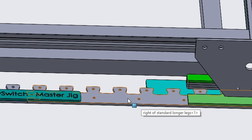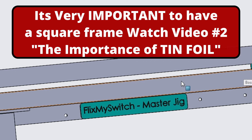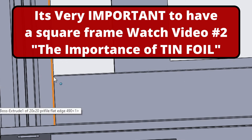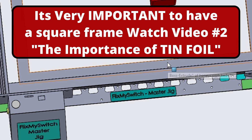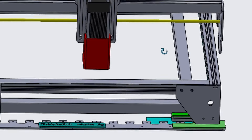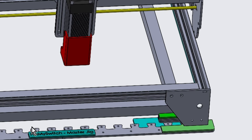The main part of the jig is getting the honeycomb square with your laser frame. If you haven't built your laser perfectly square, go and watch my long video where I insert tin foil into the gaps between the vertical and horizontal profiles to get the frame square. If your frame isn't square and you start making parts that need to interlock, there's a high probability they won't lock together, and squares or circles won't be perfectly square or circular. Anyway that's the very basics of it — I hope you enjoy the glue-up video. It's video one of a two-part series. Let's go on to cutting some parts and getting it glued up.